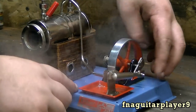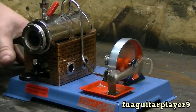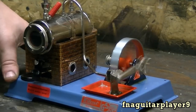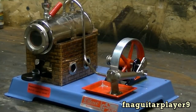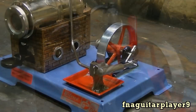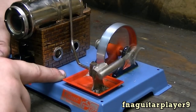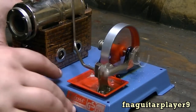It looks about ready to go. It's not up to full pressure yet — it usually runs a little faster than that. You can see the leak I was talking about around the whistle — it's not a big leak but I am losing a little bit of pressure from there. I'm going to try to get another washer to fix that. We should be up to pressure now — there we go. That's why you want to anchor it, because it walks all over the place. I recommend anchoring it like I said earlier.